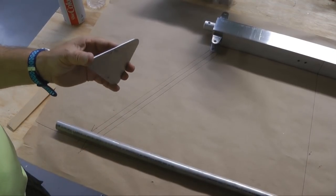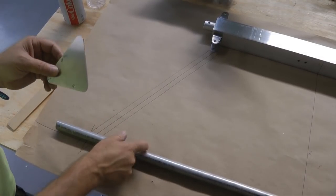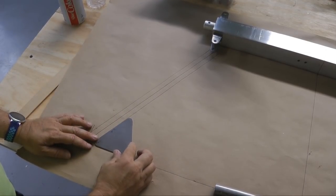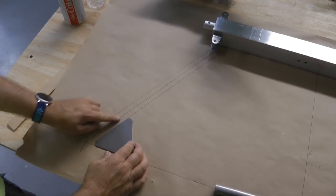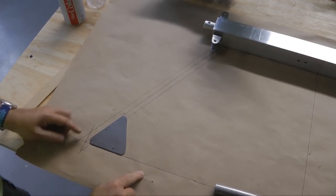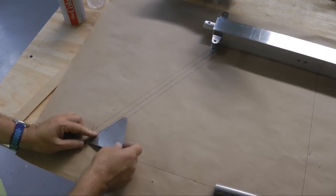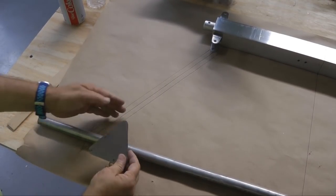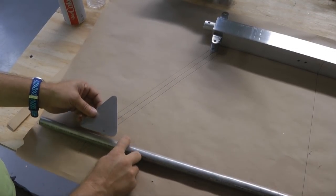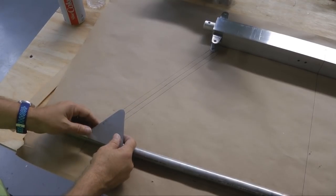Check your plans. This is made out of 90 thousandths aluminum, a little bit thinner than the sheet we've been working with. And the important thing with these is, if you notice, once you've made them, they should match very nicely the angle. Actually, that's my center line right there. The angle between the bottom axle and the center line of the connecting tube. And what will happen is this will go on top of both tubes and also underneath both tubes. So the tubes will be sandwiched between two of these, identical size, and we'll drill holes that will match the tubes coming in both directions.